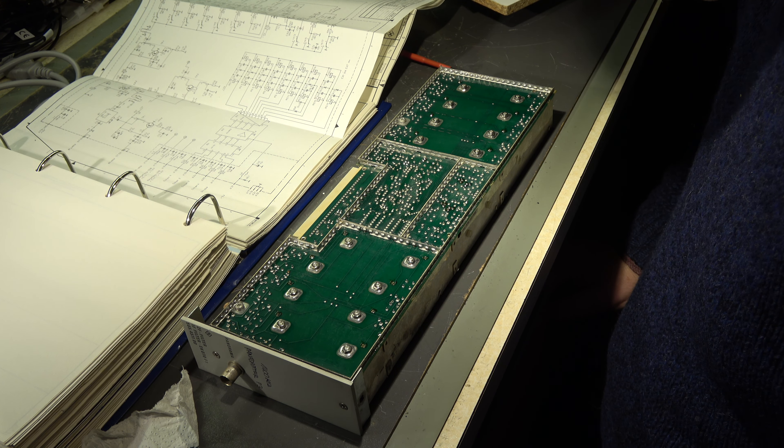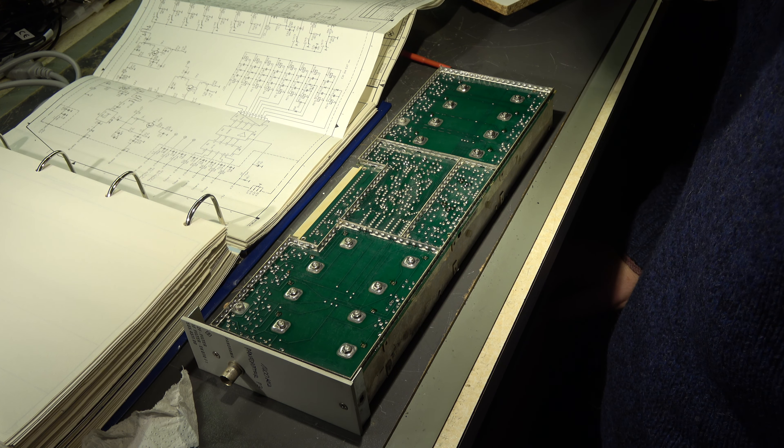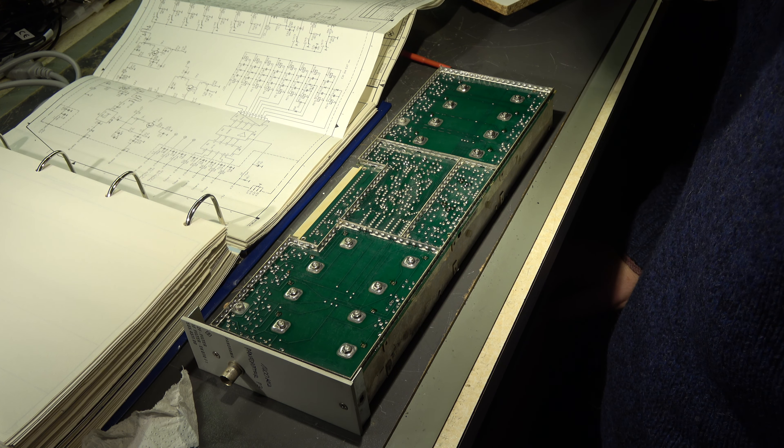Really don't understand why — someone was in there and resoldered it. Was there a problem with the filters? Can't imagine. Anyway, I will now check the electrolytics. Each electrolytic has 10 microfarad. I check the quality — they are in parallel with the choke, so we have 20 microfarad at 120 Hz, quality is 5. I think these two electrolytics are also okay.